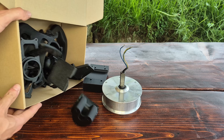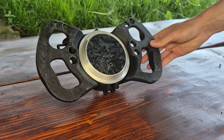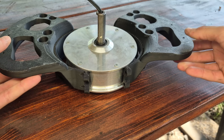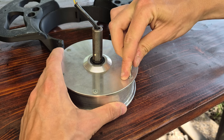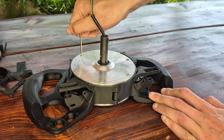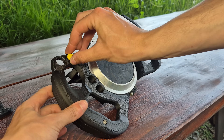With the components printed, we can see how the steering wheel is constructed around the motor, with the two halves that get bolted together using M2.5 bolts and a 3 millimeter nail as the pivot axle. If the 3D printed parts can't slot nicely into the motor groove, you might need to loosen the eight bolts that hold the motor together to increase clearance, then tighten them back when fitted. The front part of the wheel can then be completed by screwing the two grips in place and pressing eight 16 millimeter buttons into the appropriate holes.